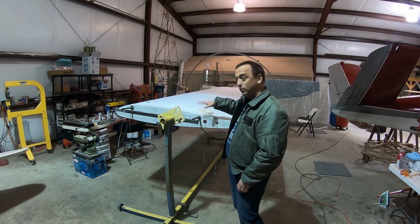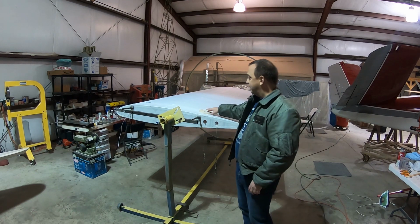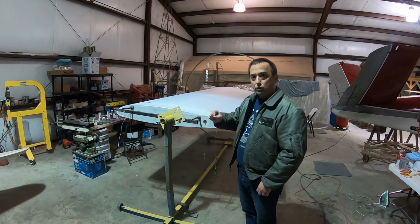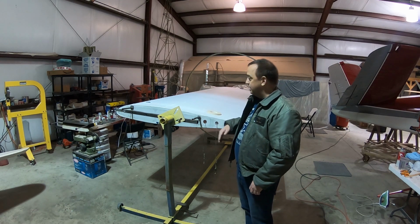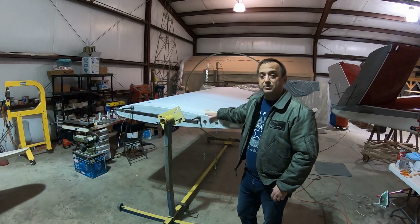The next thing we'll do in the rotisserie here is I'll lay a bead of glue on each one of the ribs, and I'll come back over that with some of this reinforcing tape. I'll get my little burning tool and we'll burn a hole where each of the holes in the ribs are for those wire clips. So we'll be putting the wire clips in all the ribs, and then after all those are in, it's onto the finishing tapes.